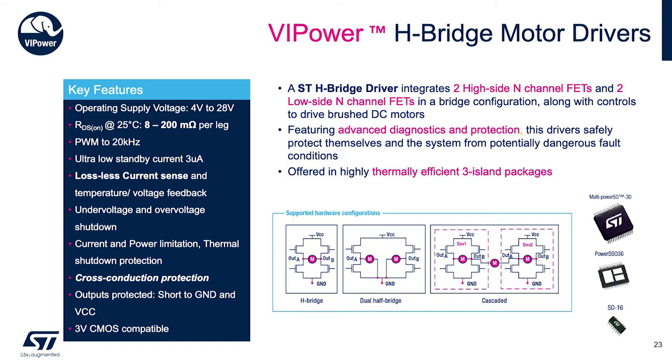Very, very flexible in terms of configurability, they have the same features as our high side drivers do. Operation range for voltage is 4 volts to 28 volts with full short circuit protection. We have 8 milliohm to 200 milliohm drivers, that would be the combination of your high side and the low side. So 8 milliohm would mean your high side driver and your low side driver would be an 8 milliohm path. All of these drivers are capable of being pulse width modulated or switched at a rate of 20 kilohertz,